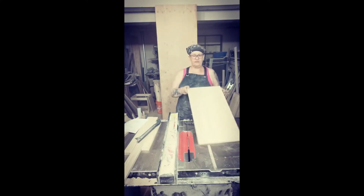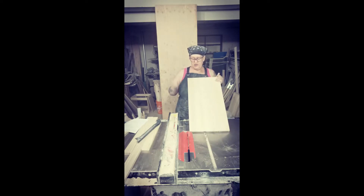Let's give these a quick sand, cut the miters in, and I'll show you how to build a door pretty soon. Again, with that leftover 24-inch piece, I'm going to cut one strip at two and three-quarter inches — that's going to be the front piece on the bottom, underneath the door. I'm going to cut another one at two and three-quarters, then put an 11-degree bevel on it so it'll match up with the top of the door and the angle of the wall.